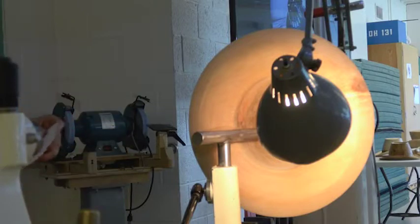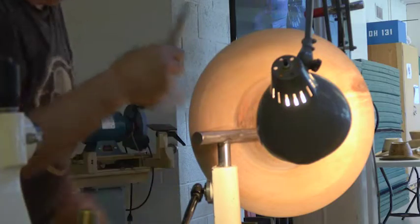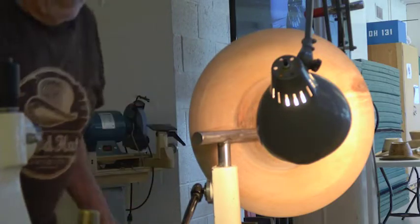And then I also do 360 Abralon, the bigger box stuff. Abralon is great stuff. It's stupid expensive, but it does the job. 360 grit, and they're 6-inch diameter. That's why the box is bigger. So they stick out here a half inch and give a real fold-over edge. It amplifies this effect. So it makes a very good finish inside the hat, all around. Totally removes all the scratches.